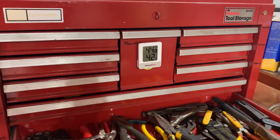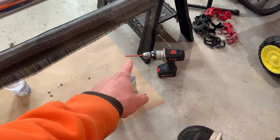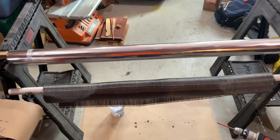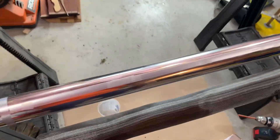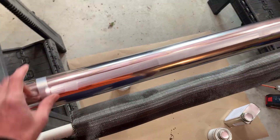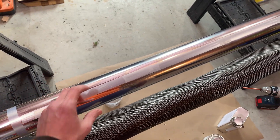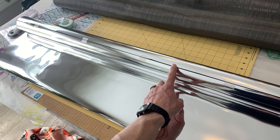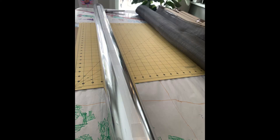Some quick tips and tricks: a 1500-watt space heater when your garage is 45 degrees is a good idea. Keep your epoxies warm. I like to stir with a popsicle stick and an electric drill. The setup is basically the cloth feeding from the bottom onto the mandrel. The mandrel is just a motor case with two layers of mylar. The first layer has its seam 180 degrees opposite, tacked with a couple pieces of scotch tape, and then the outer layer has scotch tape run the whole length so epoxy doesn't get between the layers.